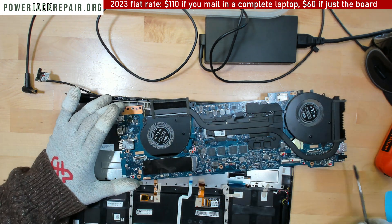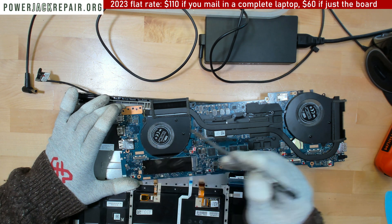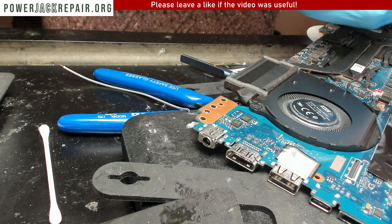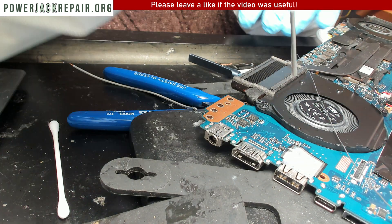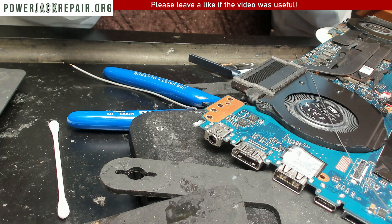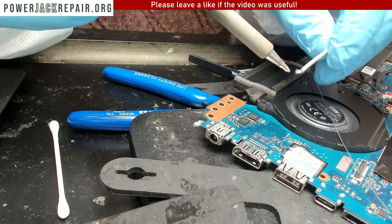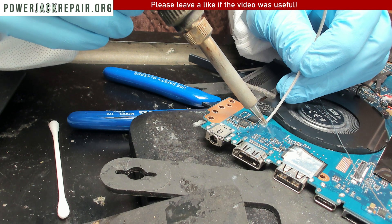What I'm going to do is add a wire right here — solder wire — put the voltage through it, and then we're going to look on the thermal camera if anything shows up. Let's take a look. I probably need to add some flux to the area, right here like that. Let's bring this in and solder this wire right there.